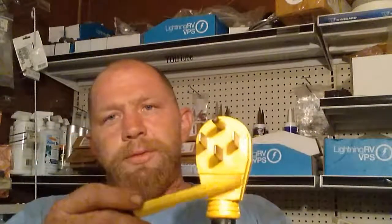A couple of people made a mistake in some of the calls I've had. Half their coach ain't working. Okay, you need both grounds. Don't think you got a dryer plug that's got 2 powers and 1 ground and you're going to make that work into this. Okay, it's not a safety ground that you're dealing with here. Normally on your 110s you have an operating ground and a safety ground, a touch ground, so if you touch it you're not getting electrocuted.